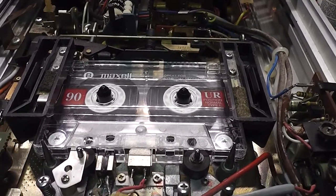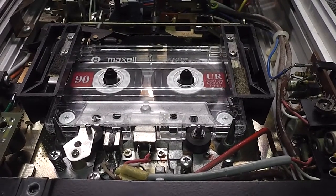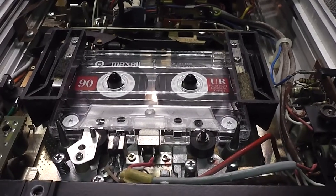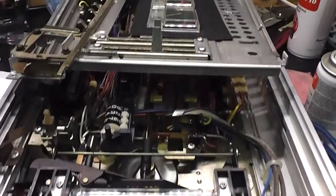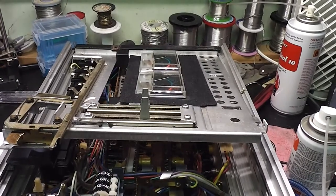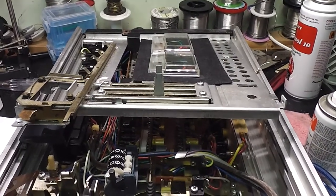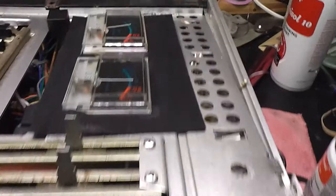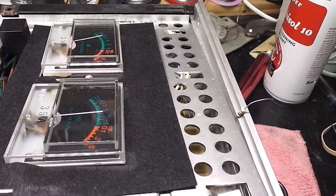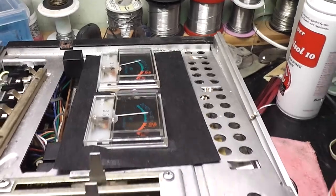Where are we with this? I've been having a few random stops - playing for two or three hours and there are still occasional random stops. I need to investigate whether it's switches or the timing circuit. I recorded with it using 0dB as a reference, but on playback we're about 10dB down - confirmed that on another deck. Playback from another recording isn't too far off though - that was recorded at about 0 to minus 3dB and reads right, although the left channel is reading a lot lower.